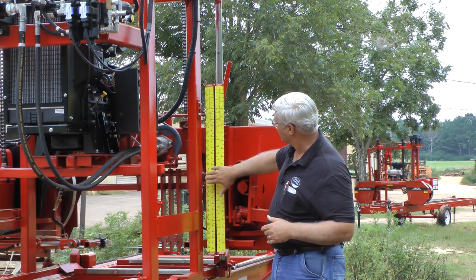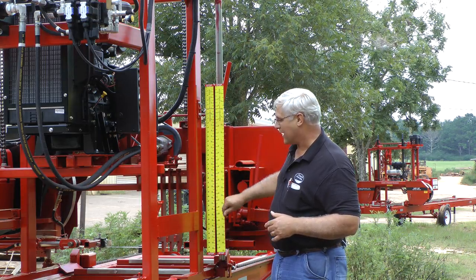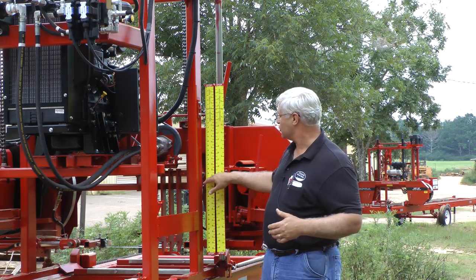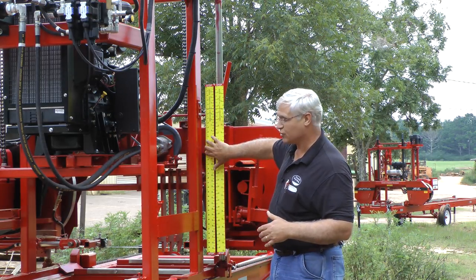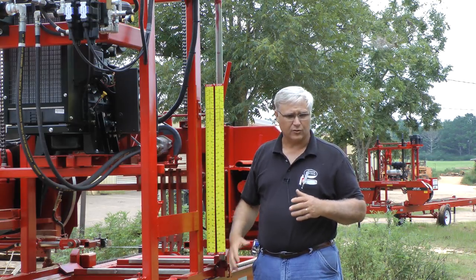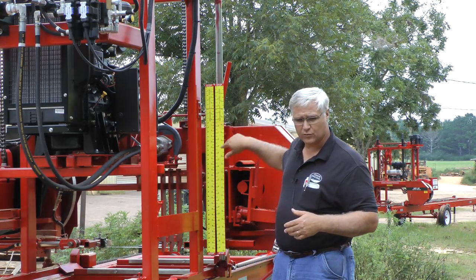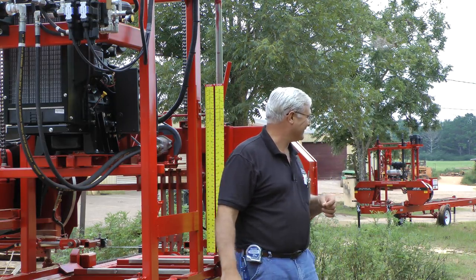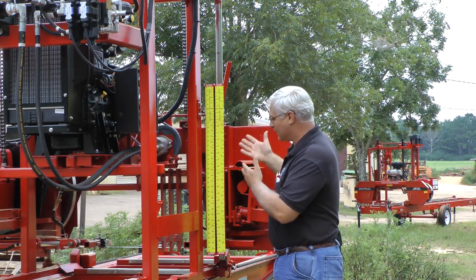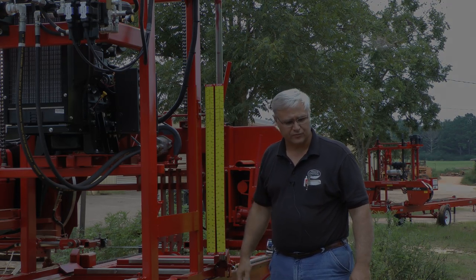You can square up with your inch marker and you'll know — if you've got a big log, you can square it up at 20 inches or 12 inches. That's what this is doing; it shows you how wide or how deep your log is. Then you cut your final with your four quarter, five quarter, six quarter. Got some guineas out here making a big racket, but anyway, just wanted to try to help you understand about the scales. Maybe this will be helpful to you. I'll see you in the next one.